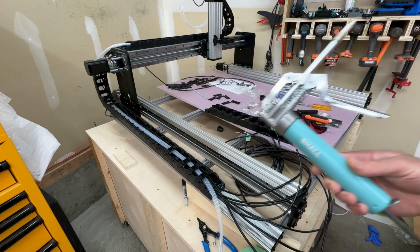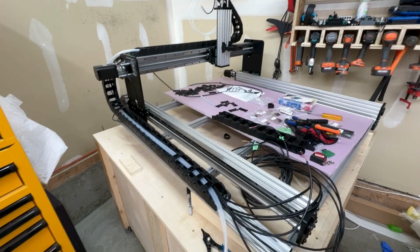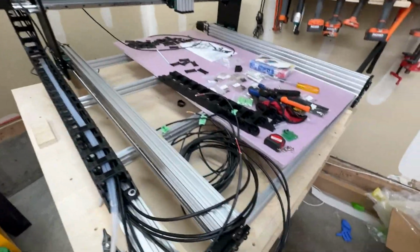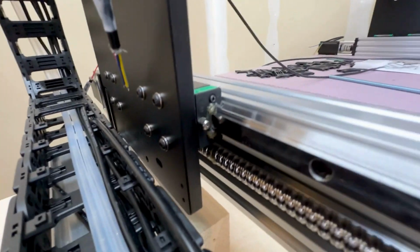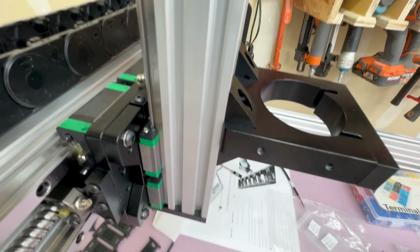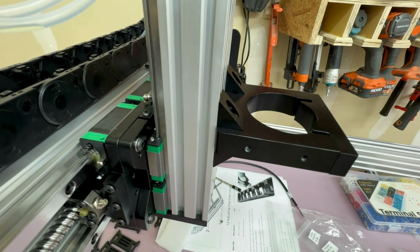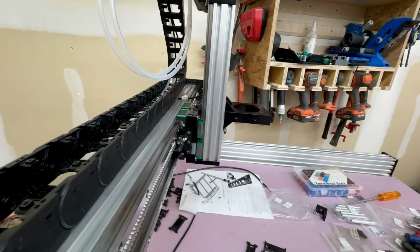The interesting thing is when you look at re-lubricating, if you need to service things in the future, some of these are hard to get to. So that isn't going to be too bad. I can get the nipple off of there, and I can get to that not too bad. These are on the Z rail. These are basically impossible. So make sure you take your time and fill those up well, because re-greasing those is going to be, I don't want to say impossible, but pretty hard without taking apart a good chunk of that Z rail, which is unfortunate.